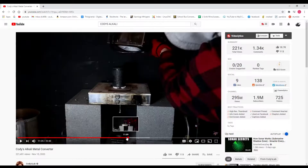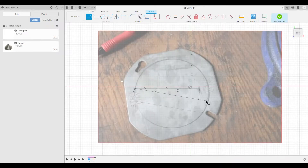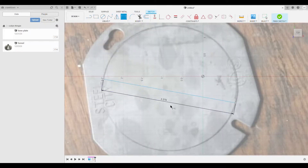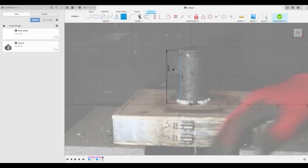We also have a clip with some CMUs in it, which are 8×8×16. We take these into Fusion 360, calibrate them by entering in our known sizes, put a sketch on top, draw a line across what we want to measure, and measure that line — it's just as easy as that. We're really Sherlock Holmes in here.